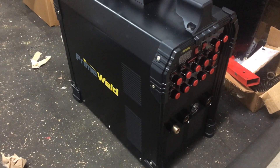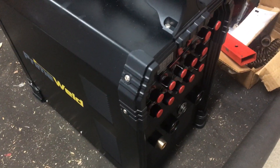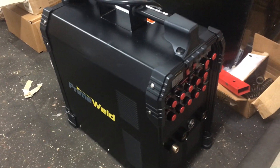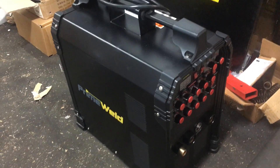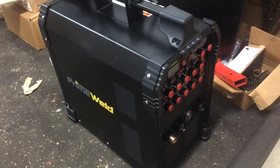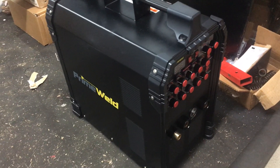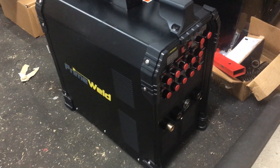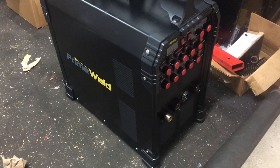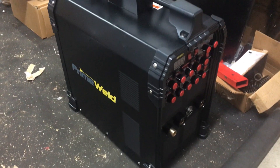So I've either got to do that now or buy the bigger generator — something you really need to think about. I did some research and it seemed like 2500 or so constant watts would do it, but it's needing a bit more now. I think a generator, or a lot of the energy from it, is not clean power. I didn't want to keep trying it and risk messing the welder up.